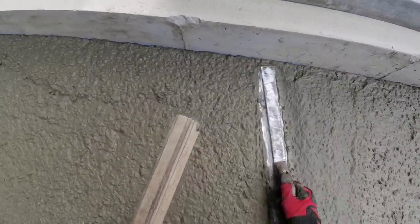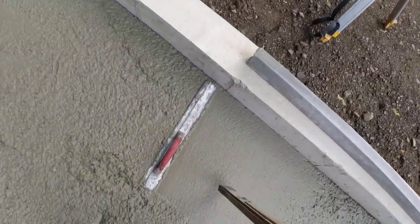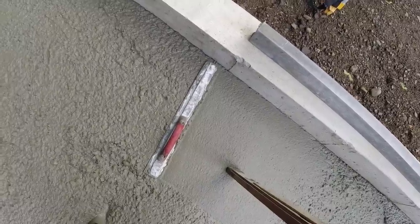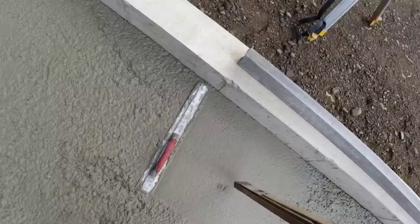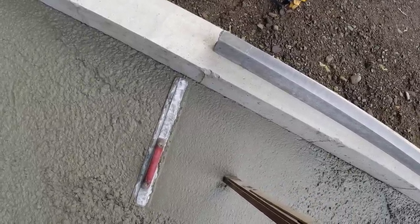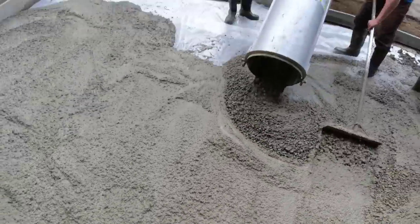So what I'm doing now is I'm checking my middles because this slopes 2 inches. I want to make sure I got the grade stick set right exactly to the slope. So the middle, when we shoot the wet pad in the middle, we're right on perfect. I got to go up just a little bit more. That should be a solid beep without the bottom of the stick sinking in to the concrete right there. Perfect. Now I can make this pad in the middle. Pretty good.